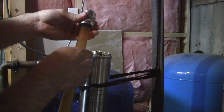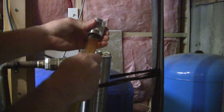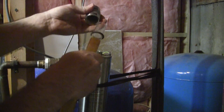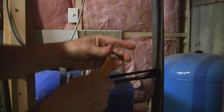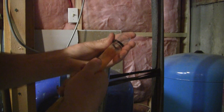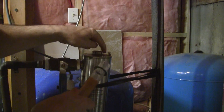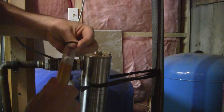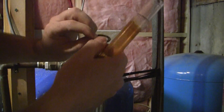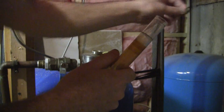The package does come with a new o-ring, so I'm going to pull it out of here without breaking it — hopefully. I broke one a few years ago and I think it was like another $94. So there, I've got it out now. I'll put on the new o-ring after I clean it, and then I'll put some plumber's goop along here and seal it all back up. The o-ring is compressed, it's shot — might as well change it, I've got a free one that came with it.